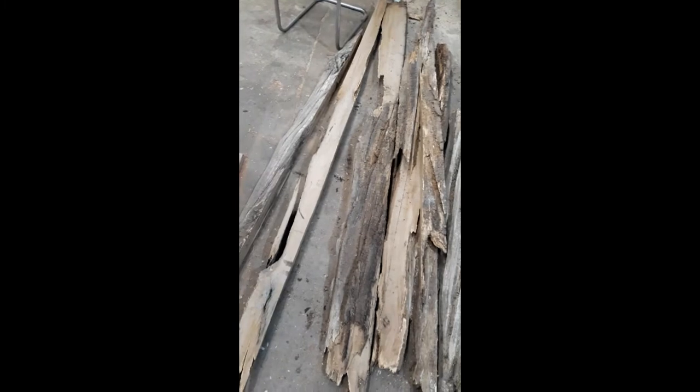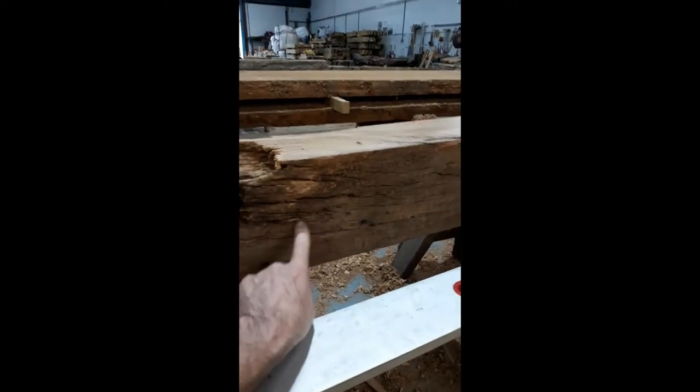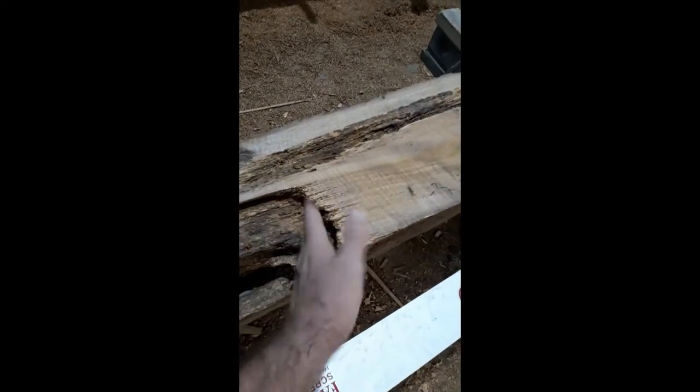This is the better face of our beam. We'll be putting a patch in here — probably something that comes down here, across on this level where the mortise was, perhaps up here. We'll put a dry section of oak in there, and also we'll probably put a plank in here to take up that void. Because this is the middle of the beam, and we want it to flex as little as possible. At this point it's got a point load from each of the two spine beams from each side, so any significant voids in this area are going to give it more likelihood to flex and move. So even this bit of recession here, we'll probably cut this down a little deeper, square it out and set an inch plank in there.